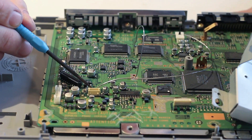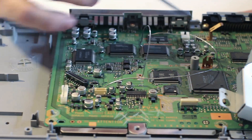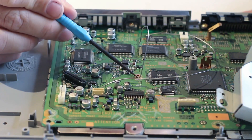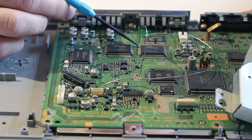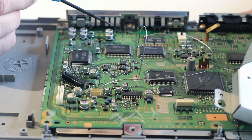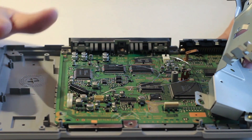First, you're going to need to connect here from your XLR port to your P5 port on this chip by simply attaching a wire and two beads of solder. You're also going to have another port right here and also right here — this is the P17 and the P12. So we've connected those two together. Now, after you've soldered the two wires, you clean up all the solder.